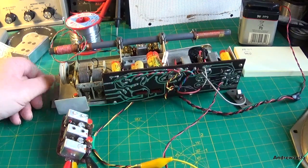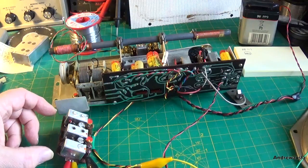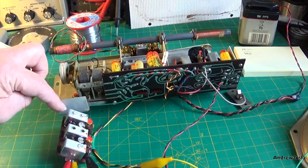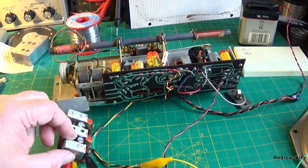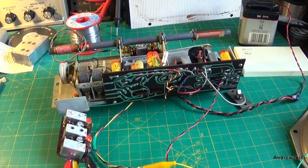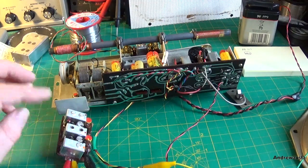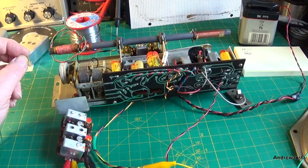No, I won't. I think that's going to be an impending disaster because these wires are quite fragile to twisting actually. So there's just this green wire connected to the top of the PCB, and I've already had to cut it to replace it. But yeah, happy with that. Next thing is get this soldered back in and back in place so it's all nice and rigid, and then we can go to town on the capacitors here and see where we end up.